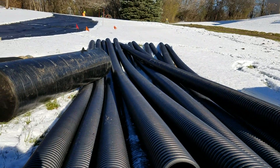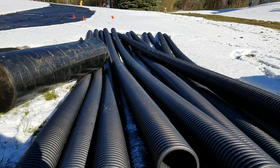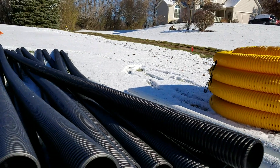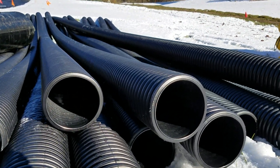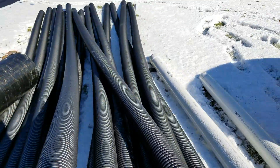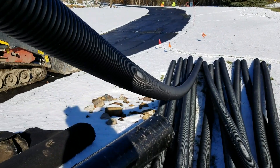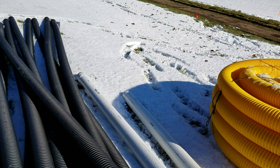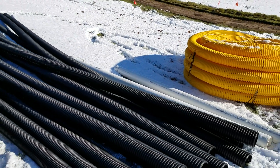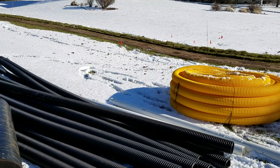So these are the ingredients to a good drainage system: the gravel, the geotextile non-woven fabric, the nice perforated pipe, and for the downspouts, the dual wall corrugated pipe. Here in Michigan, it needs to survive the freeze and thaw cycles, so it has some flexibility — you can see where this has a little bit of flexibility. The ground is going to freeze, it's going to heave, and we're going to see all kinds of stresses on our pipes. That's why corrugated pipe is the right pipe for the north.